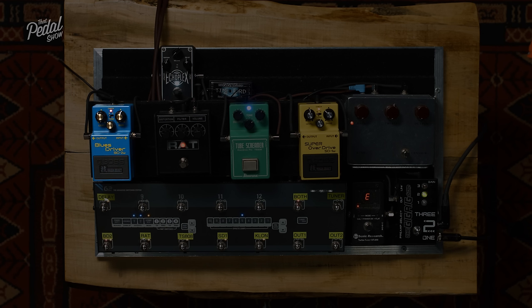As we feed more of that signal back in, we're going to achieve what we call soft clipping. It's not exactly the same thing, but think about the difference between having something in series and in parallel. You've got the clipping diodes after the op amp, and now we've got them not exactly in parallel. Sure, not exactly. So it's in series, like all of that signal is going through it, but now we're just hearing the feedback loop going through it.